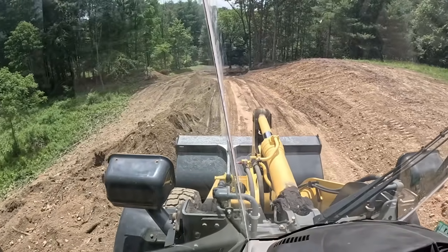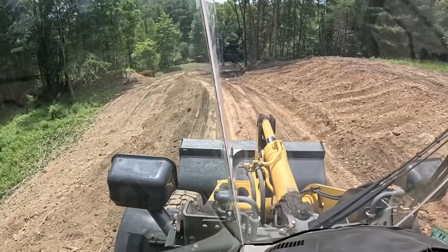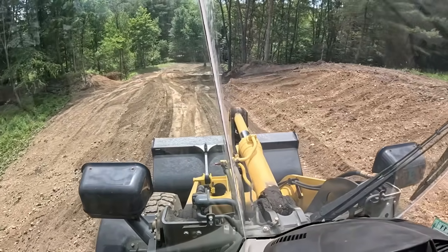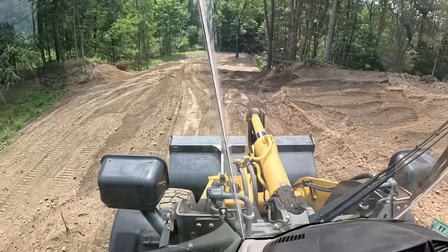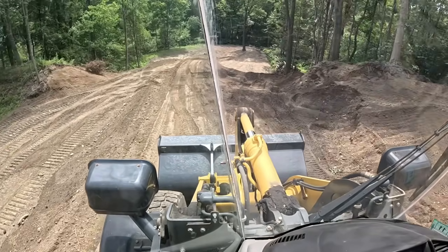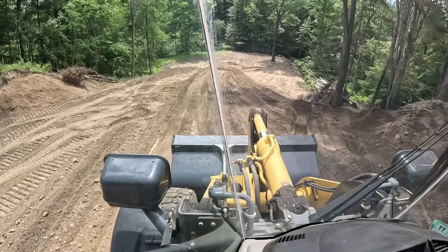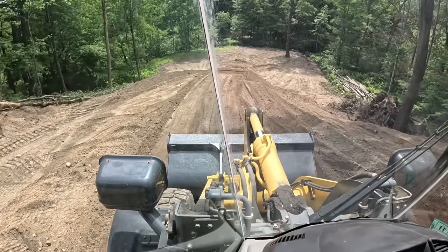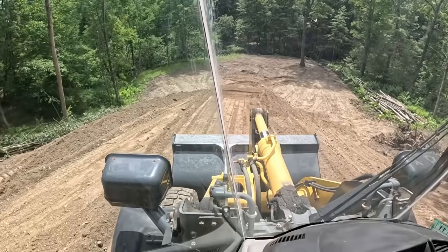Yeah, this is nothing but like a big skid steer, so the thing grades, and as that blade hits the bottom there, it burns the surface, which compacts the hell out of it. But I'll get in here with the roller now that I got this established and start beating it down. Didn't make no sense to have a roller in here too early, because you're just gonna get stuck with it. You're tracking and packing in lifts with the dozer coming up. It's not like you're throwing in a 10-foot lift, you know.